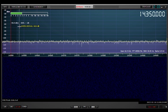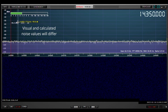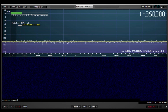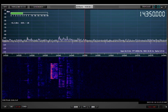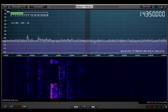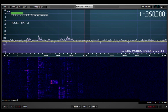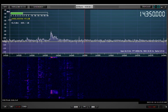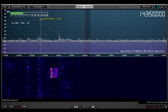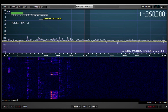The software is calculating the equivalent input-referred noise to the receiver. With the preamp bypassed, it's showing about minus 94 dBm. Now with the preamp still bypassed but the input connected to an outdoor trap vertical, you can see the sideband activity on 20 meters. It's now reading around minus 91.5 dBm — approximately 2 to 3 dB higher than when we terminated the input with just the dummy load.